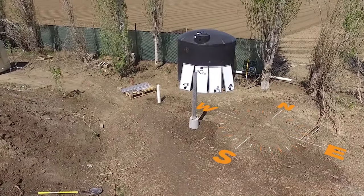If you hook up more than four of our 100-watt panels in series, you're very likely going to damage the controller. If you're using your own large panels, be very careful — a lot of larger panels are higher voltage in the 40 to 45 volt output range, meaning you'll likely be able to put a maximum of two in series with the rest in parallel. If you have any questions, there's large panel sizing in the user manual, or give us a call and send a picture of the data plate on the back of the panel. In this case, we have an RPS 400 with four panels. I'm going to connect all the panels in series, grab our solar extension wire, run it down into our controller, and then do a final plug-in for the bucket test.